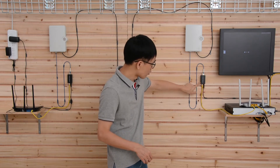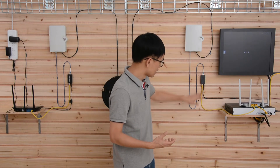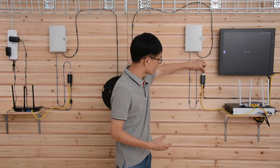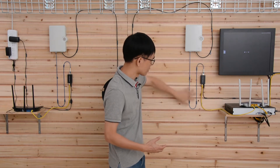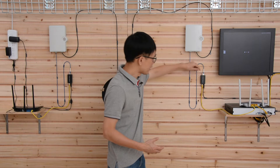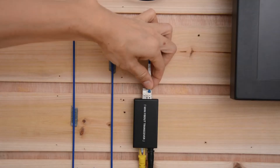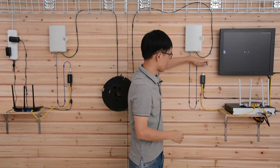This is the one port which outputs the RJ45 network port — it will link to our router. And from here we can use the fiber optic cable. There's one very important component called the SFP transceiver. Let me remove the SFP transceiver from the media converter.